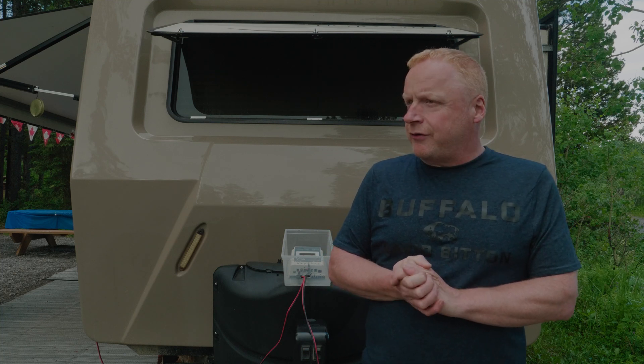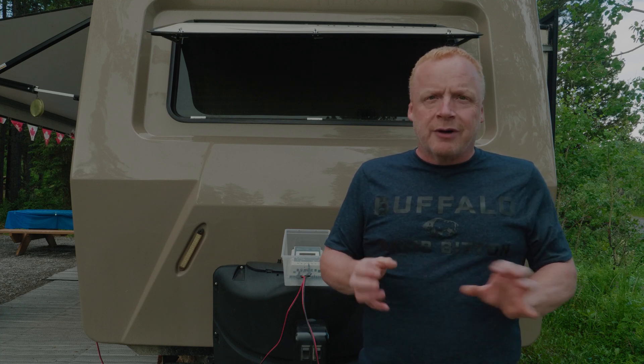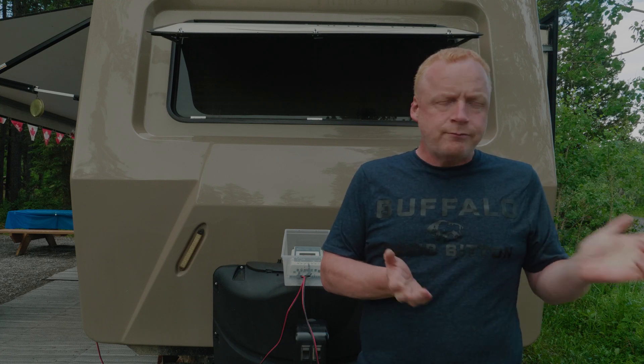If you're using a generator at 5 amps an hour, and you've used your fridge over 24 hours, you've got 12 amps to recover — that's 2-plus hours just to recover the fridge, not counting the water pump or furnace. You're definitely going to want something else to supplement even a generator. A generator by itself means your neighbors will know you well — invest in some solar.